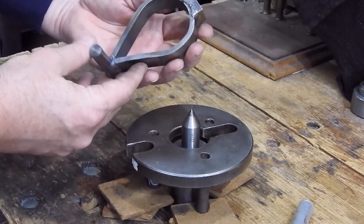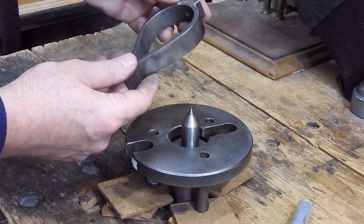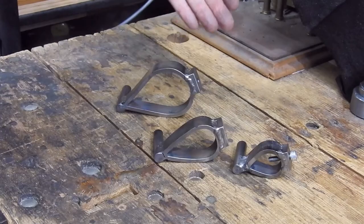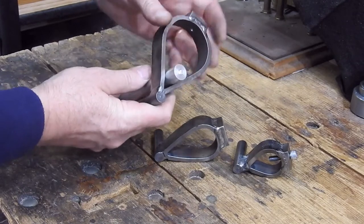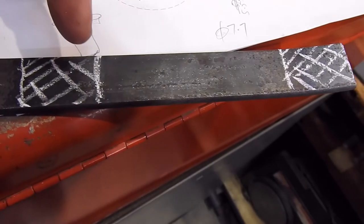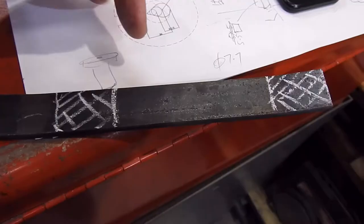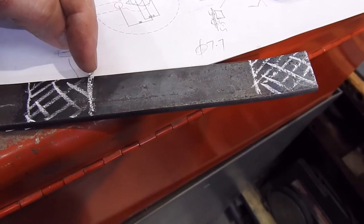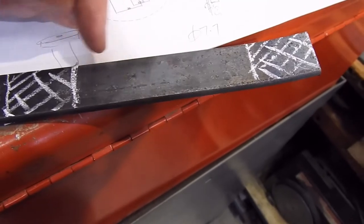These ones are just something a little bit more complicated, more involved, and I made them up to do a bit of hot bending. I was inspired by Dave over at Ingalls Coachworks to try a little bit of hot bending, and they've worked out rather well. I've done three different sizes because bar stock comes in different sizes, and it's more convenient to have several sizes to use. To get the teardrop shape I want, I've marked out the area that's going to be flat on both ends, and this middle part I'm going to be heating. I also need to be careful to heat this to red heat between these two lines, because the strength of the metal varies remarkably with heat, and if I stop unevenly I'm going to get a stiff part and I need to get a uniform bend through there.